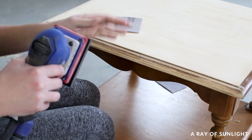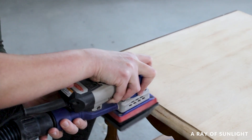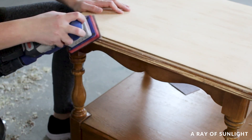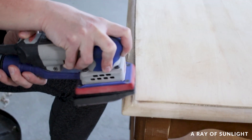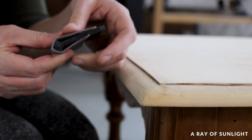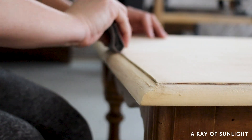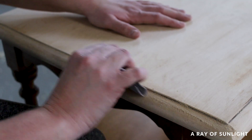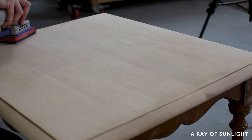For the edges, I put a thick interface foam pad onto my sander with 80 grit sandpaper to easily sand the curves. Before I put on the interface foam pad, see how hard it was to sand that curve? That pad makes such a big difference. To get into the corners of the edges, I wrapped some sandpaper around a contour sanding grip.